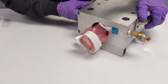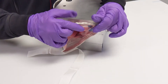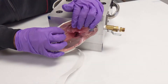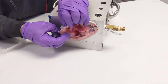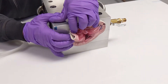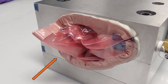Make sure the seal is on top of O-Ring locations. Use pleats as necessary to tie out extra bag. When sealing the vacuum bag to the other side, ensure you go around the vacuum pass-through port. Ensure the vacuum bag is sealed to the mold flanges only and not to the feet, as that will cause a potential leak path.